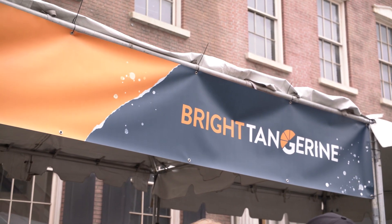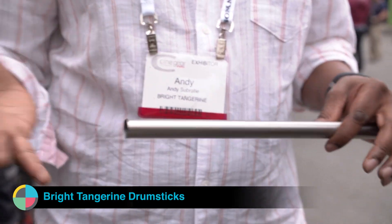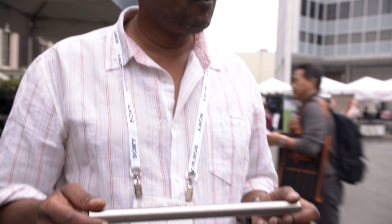I'm also noticing these new rods — some of the lightest rods I've ever felt in my life. Tell me about them. So, a lot of our customers really want to get their weight lower. We looked at the normal 19mm stainless steel rods and noticed they were really heavy. So we looked at different materials and came up with a blend of titanium, which we machined and created this rod — a quarter of the weight of traditional ARRI stainless steel rods. We make a 15mm and 19mm OD in various lengths.